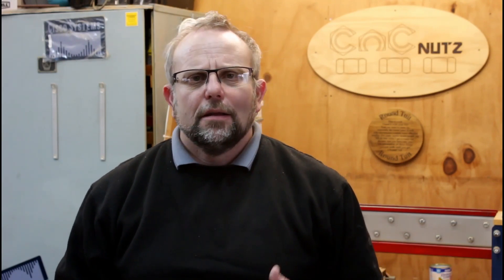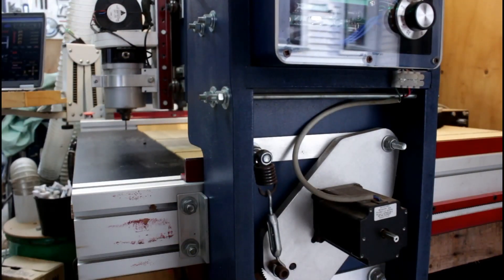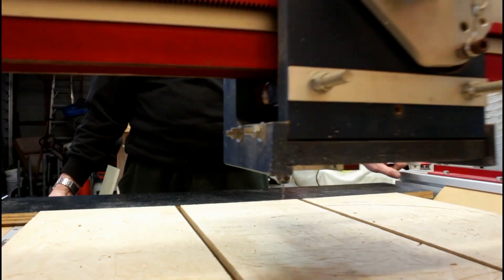The ones you definitely need are hard limits. In my case, the X-axis has a built-in hard limit in that it cannot travel outside the vertical uprights of the rail. On the Y-axis there is no such upright, and without hard limits installed the gantry can actually run off either the back or the front of the machine. I can think of nothing more terrifying than a router spinning at 10,000–12,000 RPM heading towards you at groin level at high speed if you don't have hard limits in place.